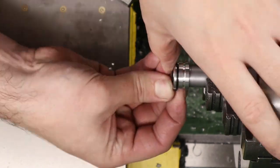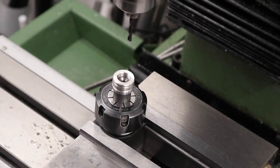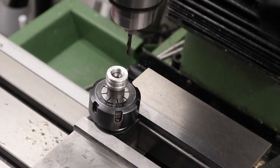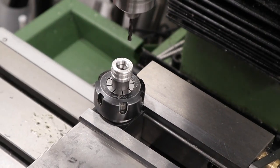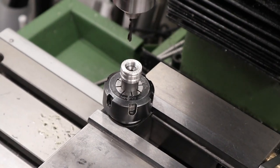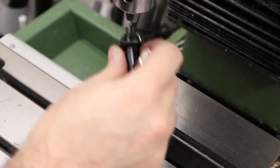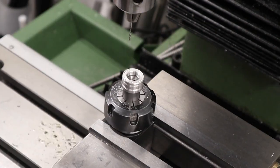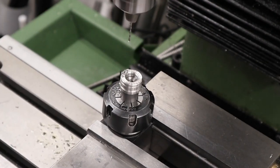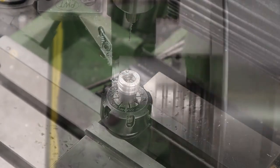Once we've got the fit we're looking for, we can move the part over to the mill and start drilling the through holes. There are going to be 24 through holes in this part and they allow air back through the shroud. The distance between the barrel and the carbon fibre tube is fairly thin and we've also got o-ring grooves to worry about, so we're using a small 1.2mm drill bit and putting a lot of holes in the device. Here we just show spot drilling the holes first and then the start of the drilling. The parts are set up in the mill and we're using the DRO to accurately locate the holes. The DRO has a PCD function — once you find the centre of the part you can specify the PCD diameter and the number of holes you want, then it tells you the exact X and Y movement to get to each next hole.